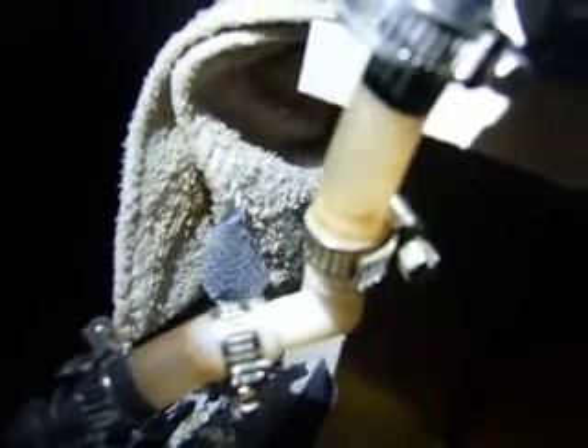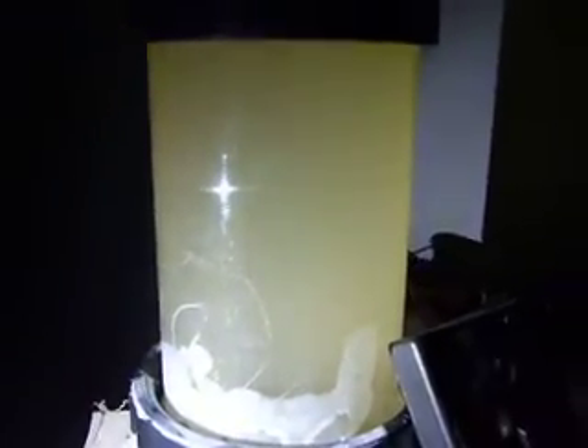Let's see if I can get you a shot of the flow coming out of this thing. It's really hammering it out. There's the return line. It's just under 5 amps, settling down to about 4.7. I don't think I'd run it any higher than that — I think it's pushing out about a liter to a liter and a half.